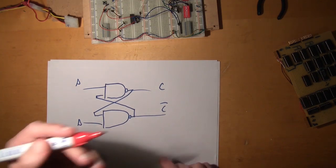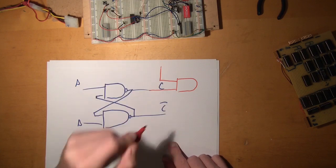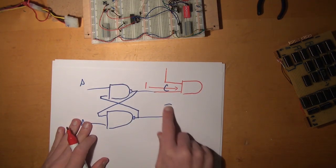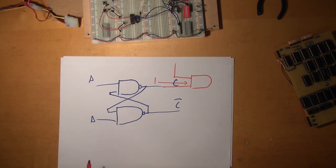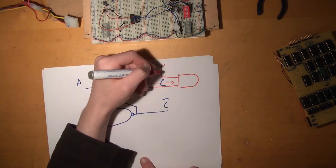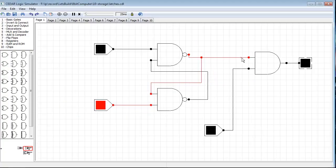You want to be able to choose whether or not a latch actually outputs something. There's a really easy way to do this — just add an AND gate here. Then we have a control line. Now, even if this is 1, the 1 will travel to this point but it cannot travel farther as long as this is 0. This control line is controlled by a control unit. Only if the control unit says 'yes, I want you to output your signal' is this line actually 1 — and only then can the AND gate actually output 1.